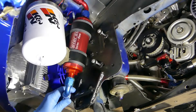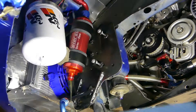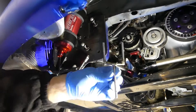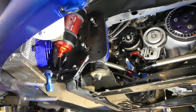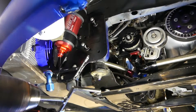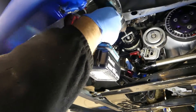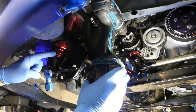I do have an oil pan underneath here. It's a good time to look at the oil — yeah, looks pretty good. I made this tool which goes into my drill. You want to use your drill on slow speed, high torque — not an impact, a regular drill. Then we're going to maneuver this up into the holes on the pulley itself. See this line right here? That's the drain we just took off from the oil filter. Watch what happens when I start to spin it — got to be careful.